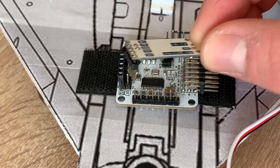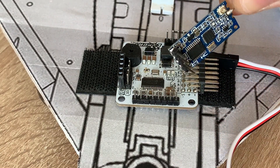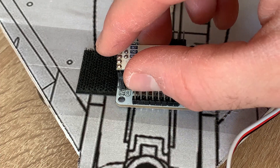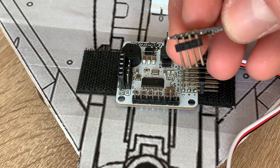I really hope you find the video very easy to follow and most importantly useful. One additional tip: I recommend using some kind of connector between the HC12 module and the board, because that's the same port used during firmware updates. So if you're going to proceed with firmware updates and want to stay updated, that's going to make your life way easier.